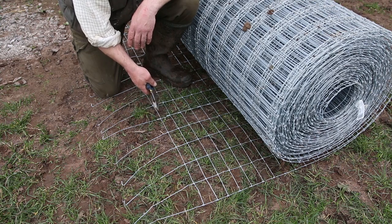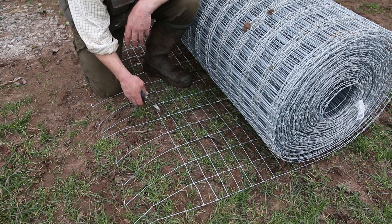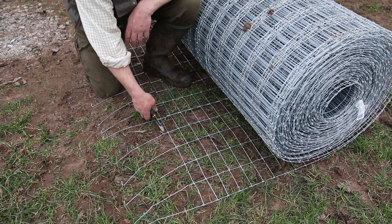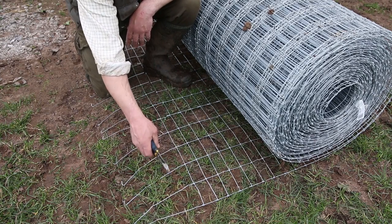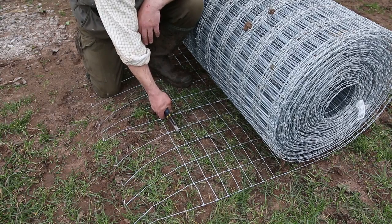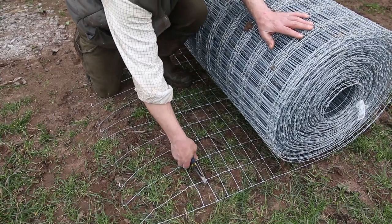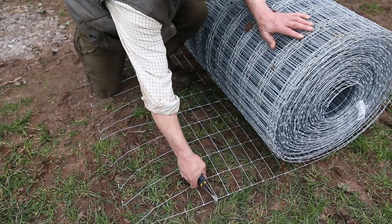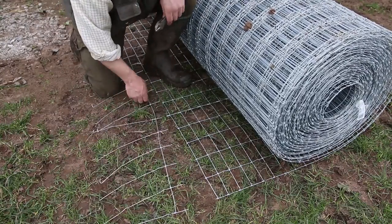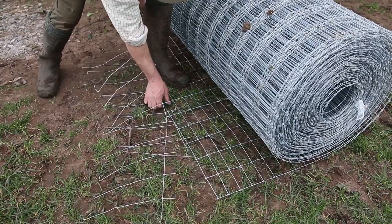Just a little tip here for when you're unrolling a new roll - rather than cutting off all the snag ends that keep the wire folded up and being left with loads of bits of metal lying around, we just go inside on the one end, cut all those nice and flush because we're going to double-staple this up to the post, cutting all the way up there. That basically leaves everything attached on one long piece so you can take that away, and it's nice and easy with all the litter to just pick up at the end.